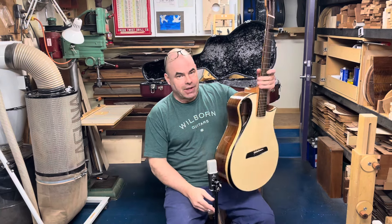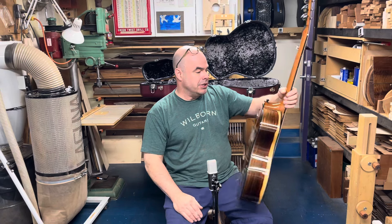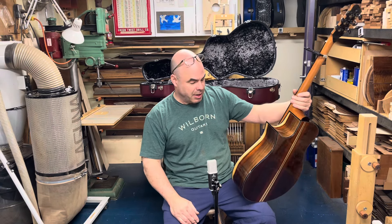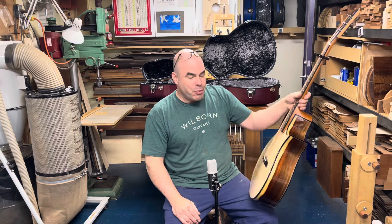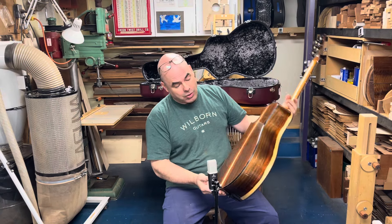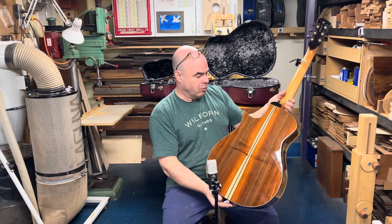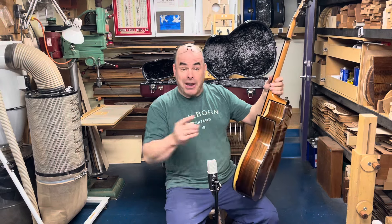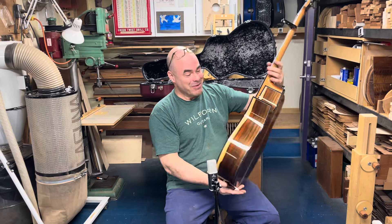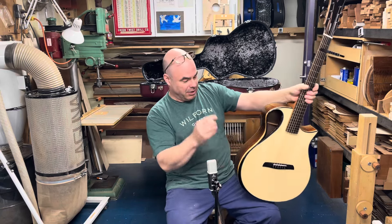I did want to point out that this red Brazilian rosewood, which I've been told comes from the Bahia region of Brazil — the mineral content of the soil there is sort of responsible for its red color. I wanted to point out the cool sapwood on this set. It has a sapwood stripe down the back, which is almost perfectly quarter sawn. The center is all quarter sawn, the sides are quarter sawn, and the sapwood is the same color as the top. I've never made a guitar that looks quite like this before. It's got a cool little ink line separation between the two.